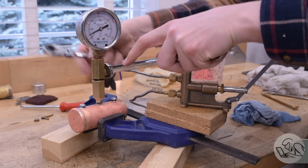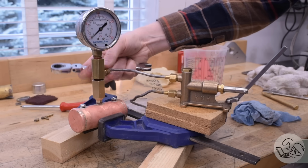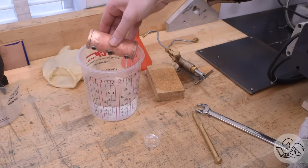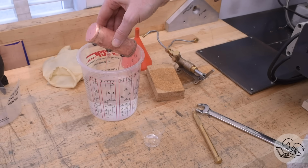Once again, I used the check valve in the pump to hold pressure during that test, which is why you saw the pressure dropping on every backstroke of the pump. For anything more than about 50 psi, you really need a dedicated check valve for a test like that.